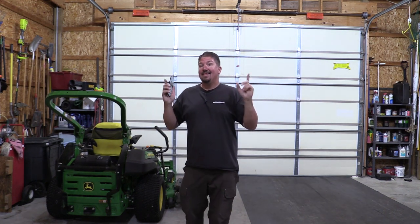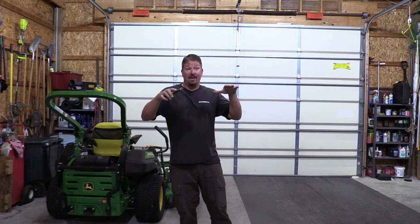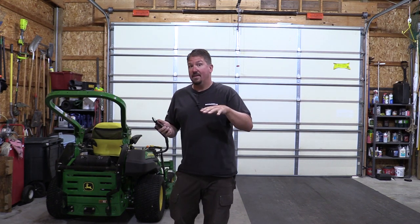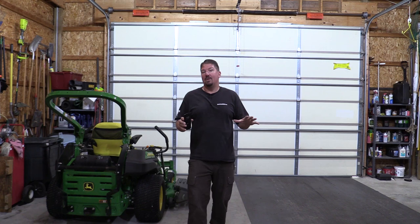If you're looking for something in your shop that's good for working around or lighting up certain areas but not just blasting light straight down, this is definitely the way to go. They're $39 a piece, which is expensive, and they are 150 watts, 15,800 lumens, 5000K — a warehouse-style, very white light, borderline blue but you don't actually see blue. I would consider splitting it up between the two types: some deformables for direct downward light and a couple of these COBs to spread light around. With white or finished painted walls, I think the outcome would be even better, but comfort-wise walking in there, there's zero doubt what I would choose.